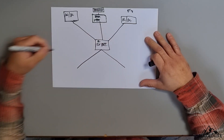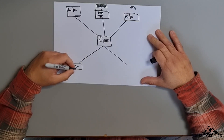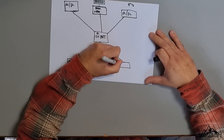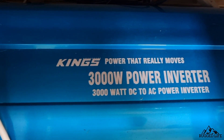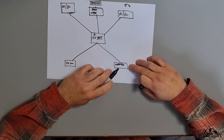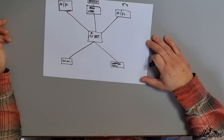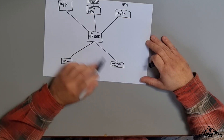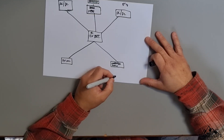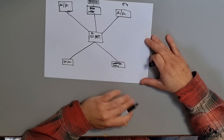From the battery, there are two ways to draw power. One is straight 12 volts — so camp fridges, lights, whatever. The other way is to step it up to AC power using what's called an inverter, or AC inverter. From 12 volts into an AC inverter, the maximum you can probably get is around 3,000 watts, because you can only go up so much from 12 volts. That means you can plug in your home appliances — a TV, microwave, kettle — as long as they're all under 3,000 watts, which pretty much all of them are.